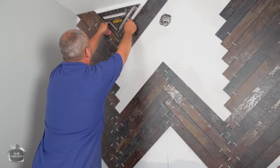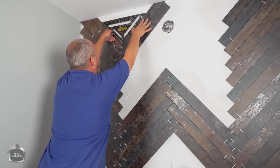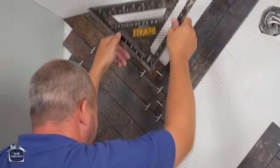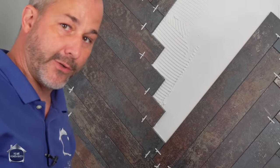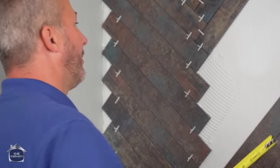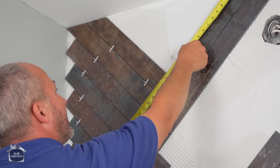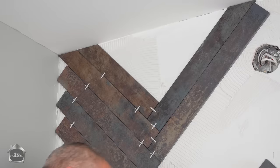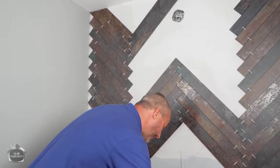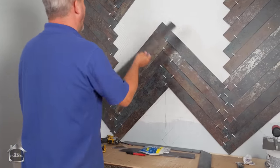We really want to make sure that as we go, we're always establishing that 90 degree corner. And if it's out a little bit, make a minor adjustment, okay? That's really nice. Then measuring and cutting is easy. Always measure on the long side. So you put your tape, pressing it up against the ceiling right where the tile will finish, and you take your measurement, you read 15 and a half, translate that information, right? Make our mark, and then you double check by holding it up backwards.